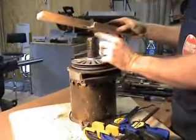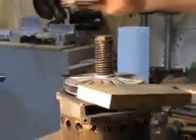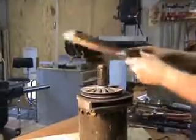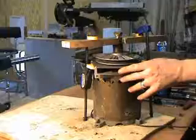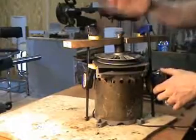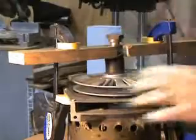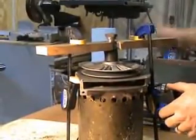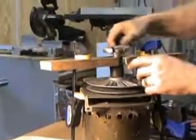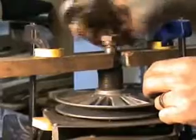In this case, I'm just untightening a nut. On all the other motors, we would use our clip pliers to take off the small retaining clip. Okay, so you can see what I've done here. I've used the board to compress the spring. I'm using a pair of clamps to hold it down since I don't have a helper typically. So now with the pressure off, I can very easily remove this nut.